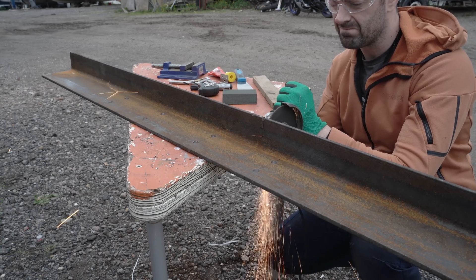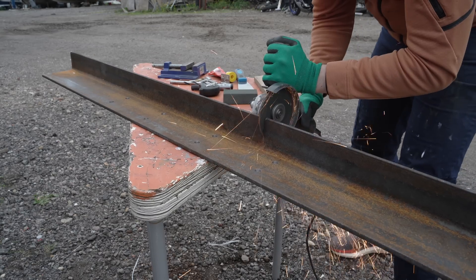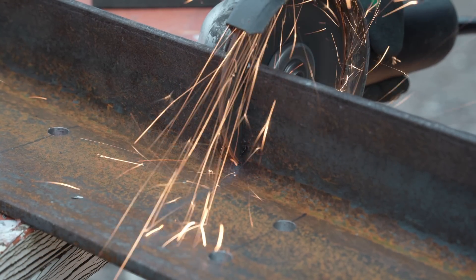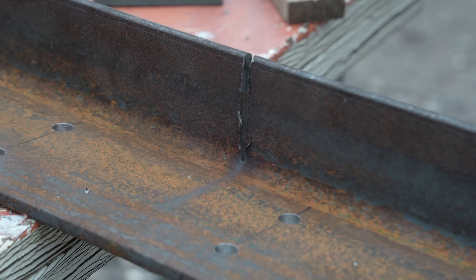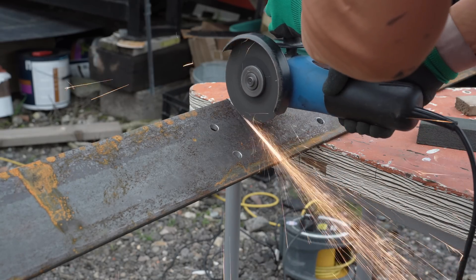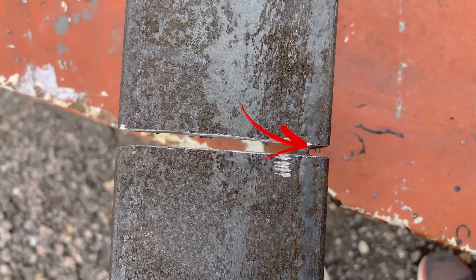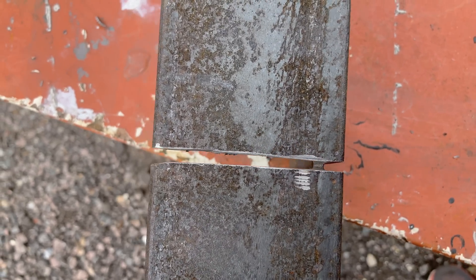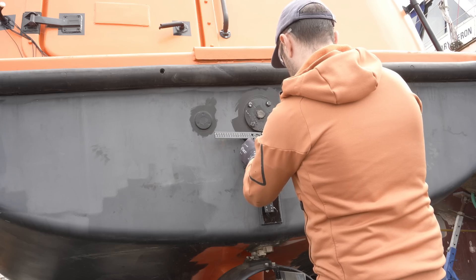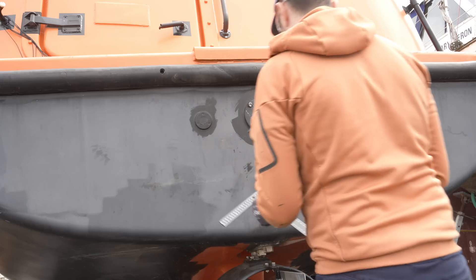This means we need to make some surgical cuts. In two, maybe three locations, I'm going to cut through the perpendicular half of its entirety, which you're seeing me do now. The next cut is made with far more caution, as we only want to cut uniformly through the flat part of the angle until it's just - but only just - able to be bent slightly with a serious yank. You can see the thickness I stopped at: two or three millimetres. Given the length of the metal piece, the moment applied to the end can now bend this at the flex point. I'm not going to bend it and then repair it just yet, as I need to have the steel positioned and seated onto the transom so I get the angles spot on.